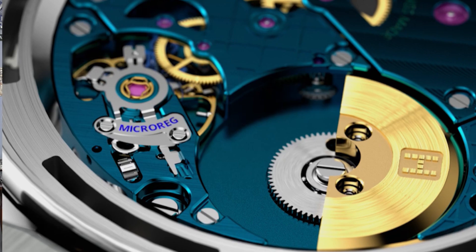I just wanted to point out that this is actually quite horologically significant. I think it may migrate to other watch companies, if only other micro brands, because it is an interesting complication to be able to self-regulate the watch without opening the case. I've done regulation with a toothpick in a Vostok, but I wouldn't do it with anything that costs more than a hundred bucks. This technology can be used on any rotating wheel balance movement, because Horage simply modified one of their off-the-shelf movements to make this one, so it's easily modifiable into other watchmakers' movement designs.